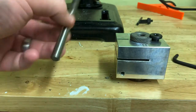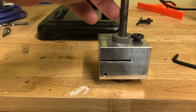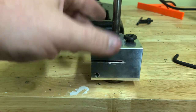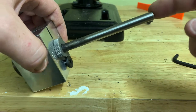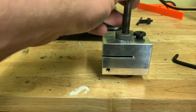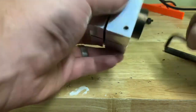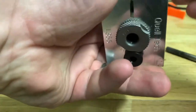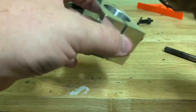Okay, so now you've got it tightened. So now you've got your center punch here. You want to slide your center punch in just like that — it'll look like this. Then you want to give it a good whack with the hammer right on top of the center punch. So now you will see you have a center-marked cup that is marked dead center using the center punch.